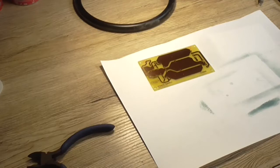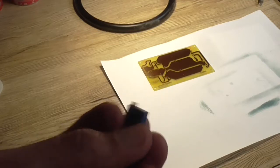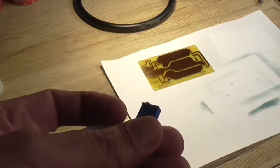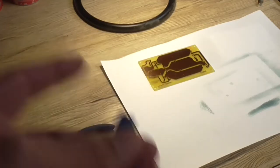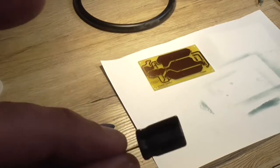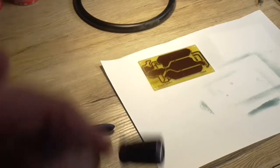Now, if I have this either installed backwards or it's wound all the way up fully clockwise, that means we can have the full adjustable output voltage of the regulators going into that capacitor. Now, if it's running at plus minus 35 volt, well, we've just now exceeded these capacitors by 10 volts and will completely blow them.